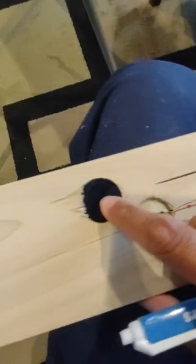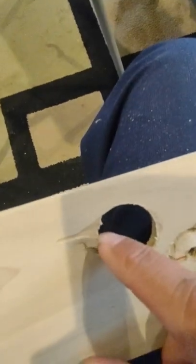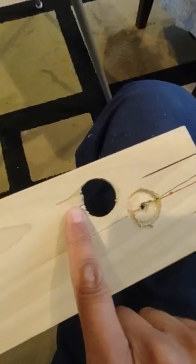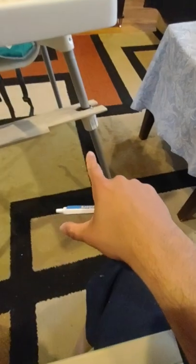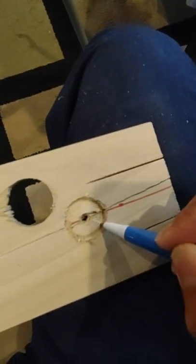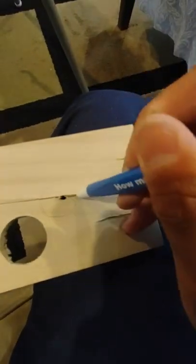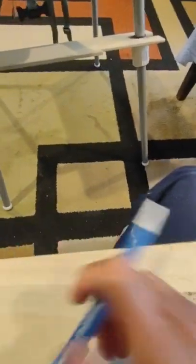I did another trial here and another one here. This happened if you push from just one side or if you don't take your time — the cut is smoother from the side you begin but the other side might be rough. What I ended up doing is drilling just halfway through, then going back to the other side and using your pilot hole to come through from that side. You'll notice the cuts come out much smoother.